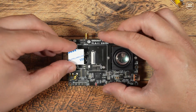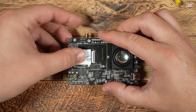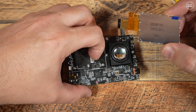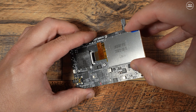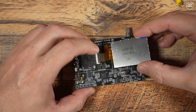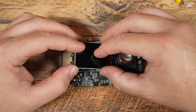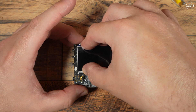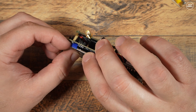Next we need to fit the screen. You'll find one small square of double-sided sticky foam — just place that just before the screen board connector. Lift the little cable securing flap on the screen cable connector and slowly slide the screen cable in with the screen facing down. Once fully in, push down the securing flap to hold the cable in place. You can then position the screen according to the rectangular marking on the main board — try to get it as straight as possible first time, as removing it could decrease the stickiness of the foam pad.